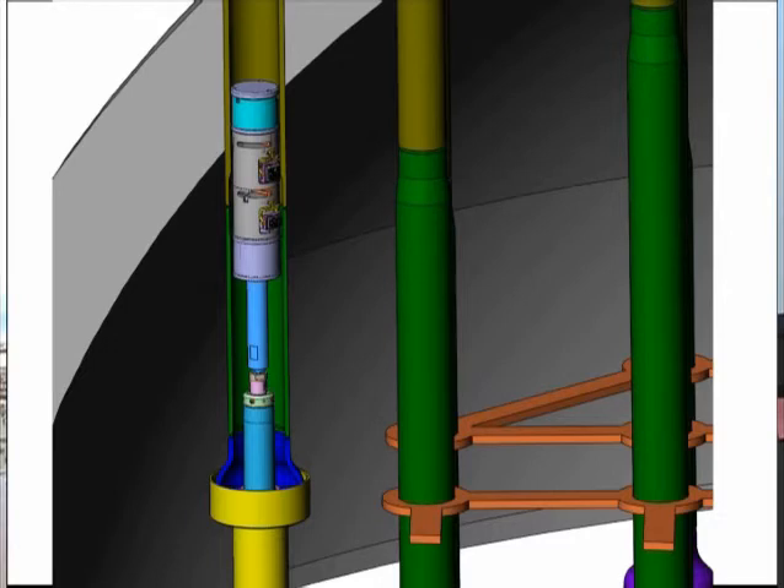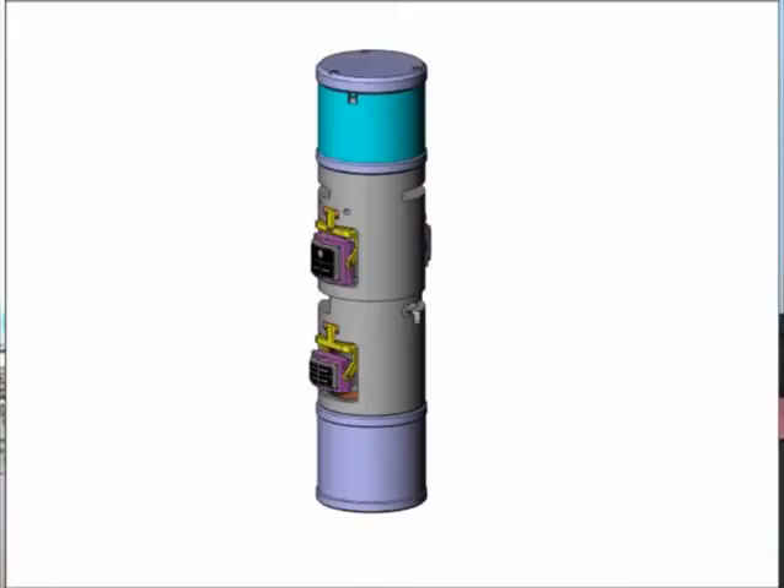We actually look all the way through the nozzle material and have to differentiate, based on the available information, between the contact of the nozzle material and the reactor vessel head carbon steel material. We need to understand if we've got a leak path in the J-groove weld that attaches the nozzle to the head, so we don't have a leakage path.